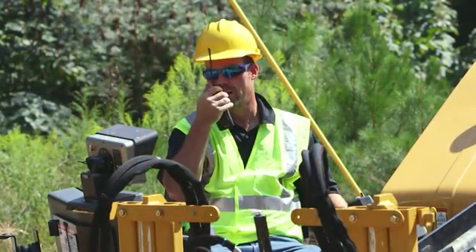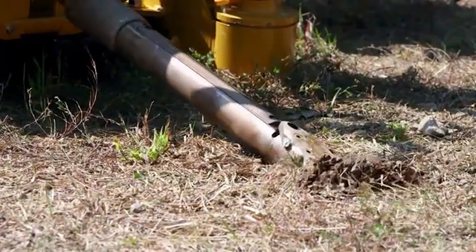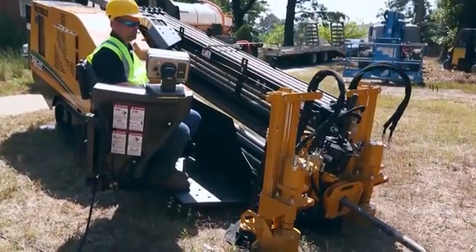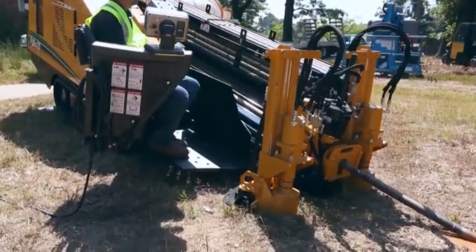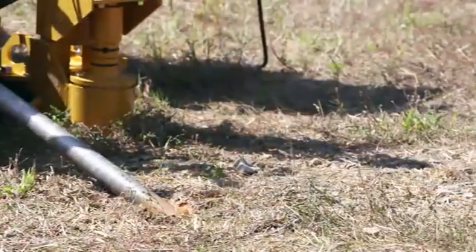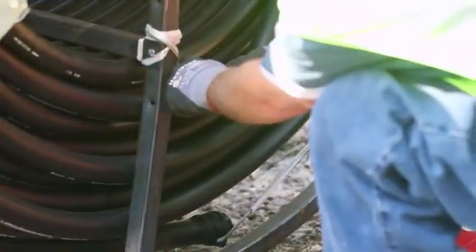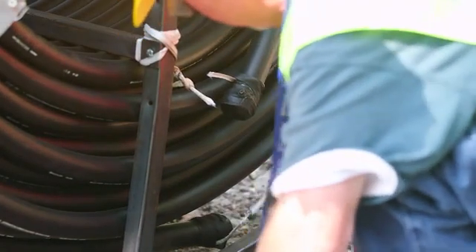Simple Cable and Conduit can also be installed through directional boring, a trenchless method of installing cable using a surface-launched drilling rig. Directional boring is used when trenching or excavating is not practical and can provide less traffic disruption, lower cost, deeper and/or longer installation, no access pit, shorter completion times, directional capabilities, and environmental safety.